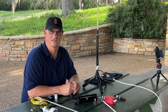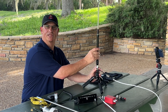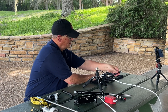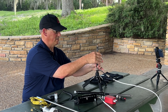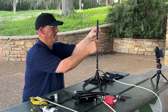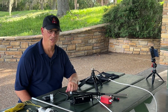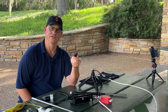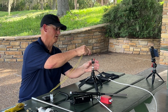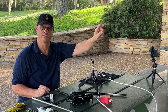Let's talk about the versatility of this Gable tripod antenna. It has an SO239 connector on it. Before we go changing out with an adapter, we're going to leave the SO239 in place and pull out our Toy Box antenna, because it also takes an SO239 connector. If you're a fan of the Toy Box antenna, you can set up out in the field with your Gable tripod and have your Toy Box antenna ready to erect on HF. If you prefer a wire antenna, get yourself an adapter. I take my radials with a banana plug through the top or side, and now I have my radial set up.